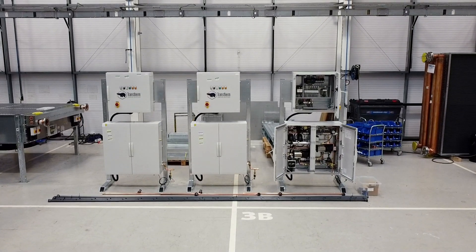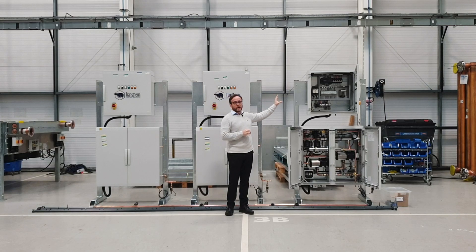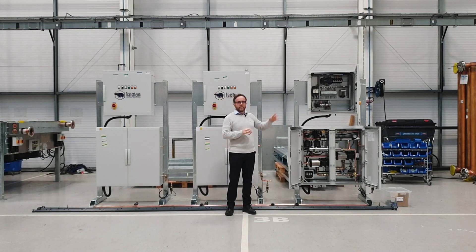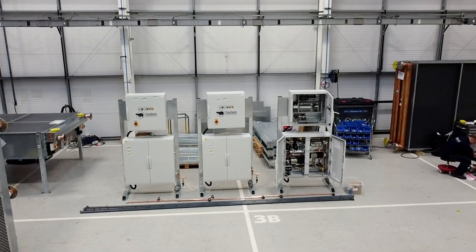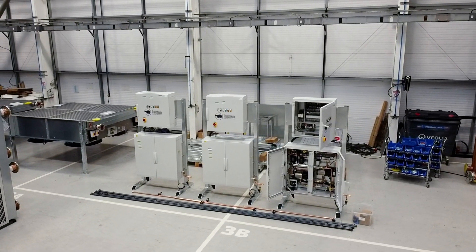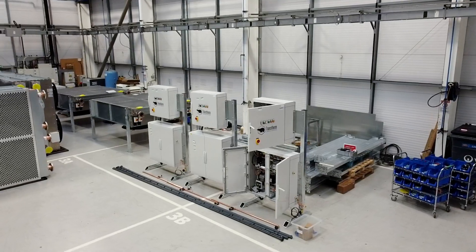So let's take a look and see what we include in our equipment. In basic terms we have our full package PLC-based control panel and our adiabatic wet box. The control panel can integrate via Modbus or BACnet with the BMS or the piece of equipment that the evaporative kit is going on, in order to minimise water consumption. It'll also take care of things like regular purge timers, UV disinfection, and so forth to handle health and safety matters. So it's fully packaged — everything's taken care of for you, it's all pre-programmed.